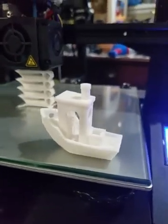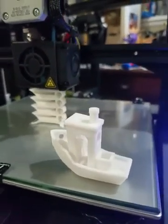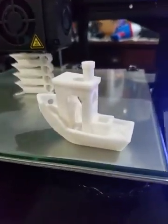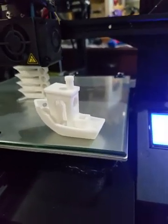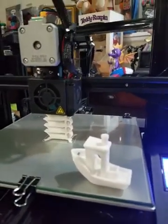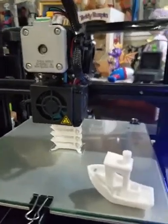The stock E-step value was 93 steps per millimeter. I did the calculation, measured it out, and it was off. Using an original motor, original gear, and original all-metal hot end — I had to change it since the plastic one was broken — it turned out to be 101 steps per millimeter. That was interesting. I had used this printer before and never checked that. In theory, same motor — I got it from another machine — same gears, same number. Nope, not in this case. I did the E-step calibration: 100 millimeters was measured and that's the same amount I went through.